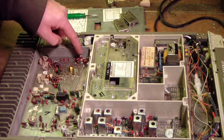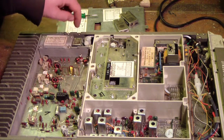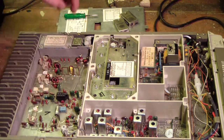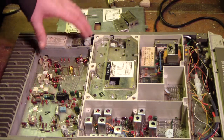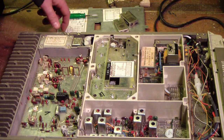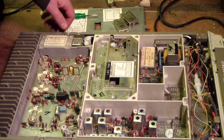Here's your voltage in, which would be 12 volts. So there's going to be switching to key it and RF in here. I almost wonder if I could use this standalone as a two meter amp — I might play around with that. I think the only thing I'll keep intact is the power amp. I'm going to tear the rest of it down. But I just thought I'd give you a look inside of the GE Master II radio.